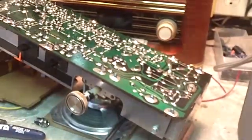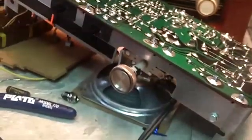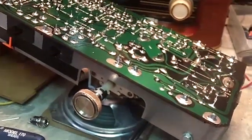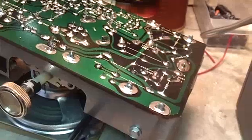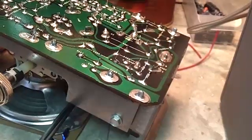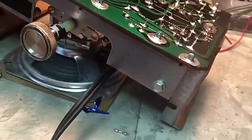If I come back again it may be trying to trace out some problems with this other unit. This one has a noisy component much like this one had, and it was going to be impossible to troubleshoot that with a noisy signal tracer. So I'm going to use the fixed tracer to trace it out and figure out where the problem is. I've already cleaned the volume control and the AM/FM switch — it's nice and clean.